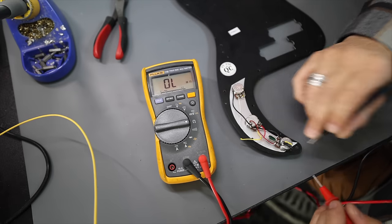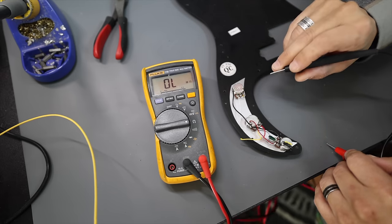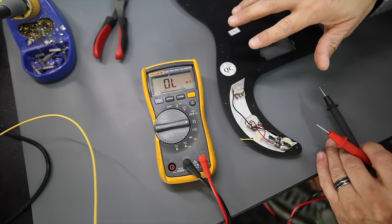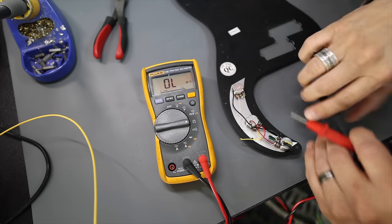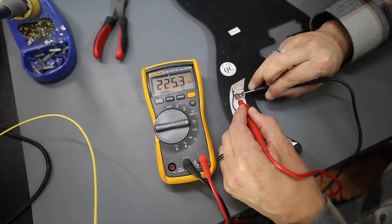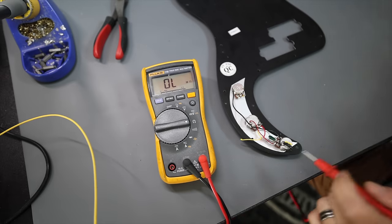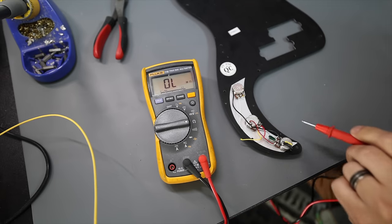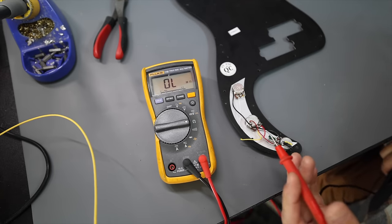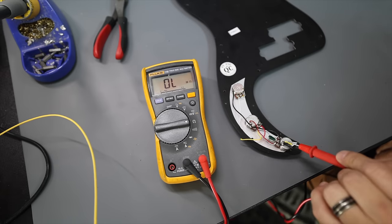This one we've got 257, and this one we've got 251. So they're all three different values. The tough part is, as we've discussed in other videos, the lower the resistance that we start with, the more frequencies we pull out of our tone — the more tone it sucks. It would be nice if they were within 10%, and these are barely within 10%, but this one's lower, this one's higher, and this one's right on.